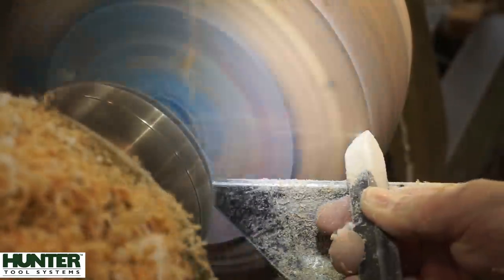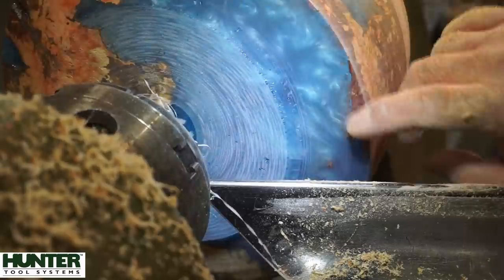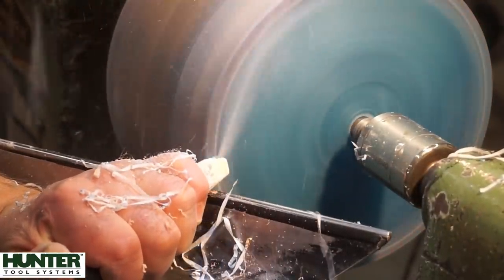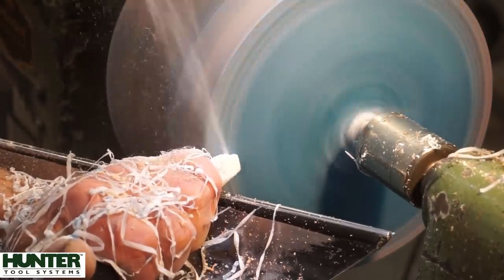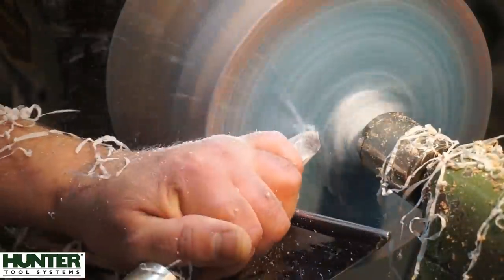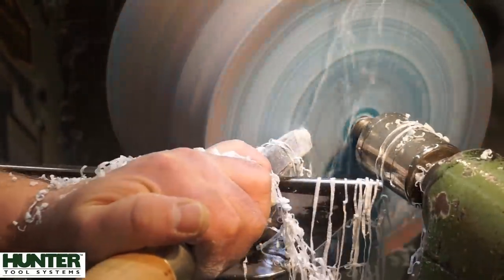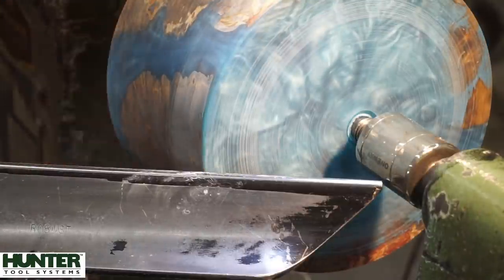This is the top of the urn and I'm just turning away all that burl that was protruding through the top. It's a good thing this piece did go into the vacuum chamber, because the combination of the vacuum chamber and the pressure pot will push that resin into areas that ordinarily it wouldn't go if you're casting on a bench. A pressure pot is probably going to give you a better casting for turned pieces like this - that's why I use one, and I actually have two of them.